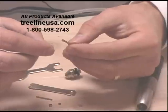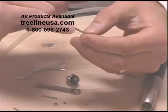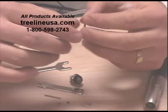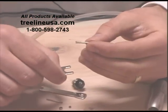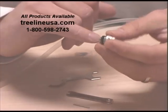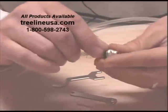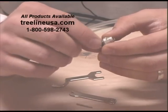Take some kind of metal cleaner or rubbing alcohol to clean up the inside and outside of this collet. You can use a little pipe cleaner down inside there to help clean it out if you need to. Make sure there's no dust or debris inside. Don't ever use compressed air to blow inside of the cartridge area, as that will force debris into the bearings.